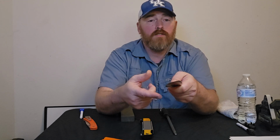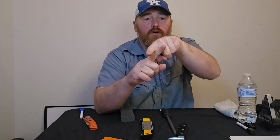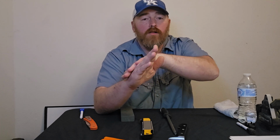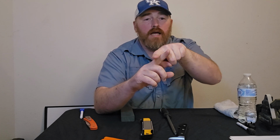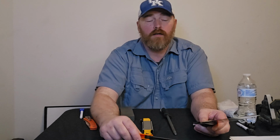All you're wanting to touch is the bevel, the edge, the sides of the peaks. That's all you're wanting to do. You're wanting to rub that across that side right there. Not along the side of the blade, but the side of the edge. That's all you want. And I keep using my hands, and I'm horrible at this, guys. I'm sorry. I'm trying to do the best I can without jerking that board out all the time.